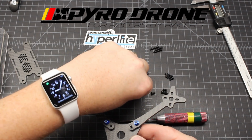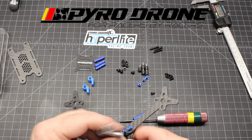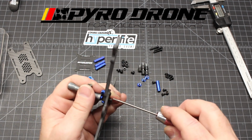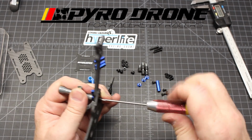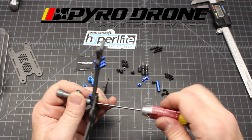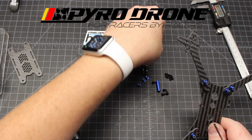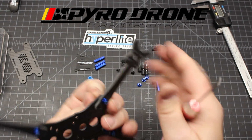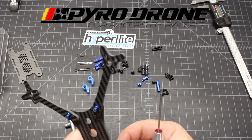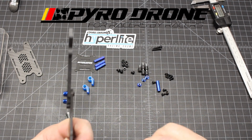I have a power driver, but when I'm building frames for the first time, especially, I don't like to use it. I like to kind of feel how things are going together, and how they're fitting. I just think for me, it helps to know how tight everything is. I like a frame to be nice and tight when you first build it. Now again with the 16mm, the front. So I'll line those holes up. You have to do a little finagling to get it through. Sometimes I just start it with the driver and start pushing it through.